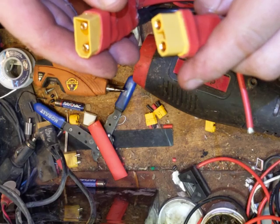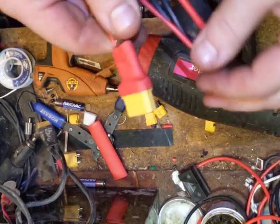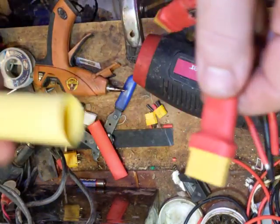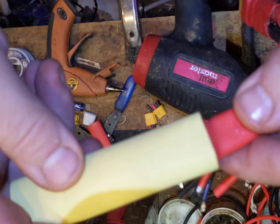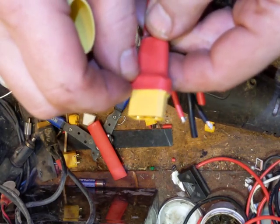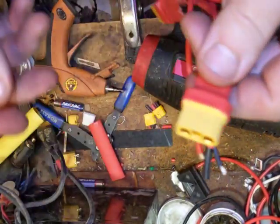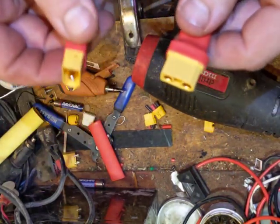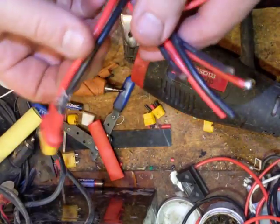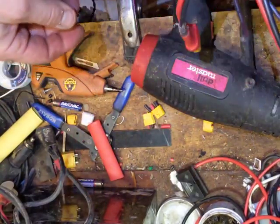So that you have a way on your 12 volt, or 24 or 48 volt system — just remember if you're using a variety of voltages, use a little yellow heat shrink. Cut about a quarter inch, heat shrink it on — it'll shrink down to just barely enough room for you to write the voltage on there. So you know, 'hey, this is a high voltage source.' I always use female for the source, male for the side that needs power. And there you go — there's all your other connections that I'll wire into these smaller XT60s.